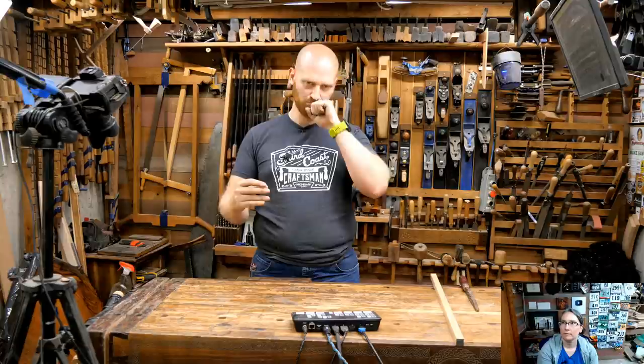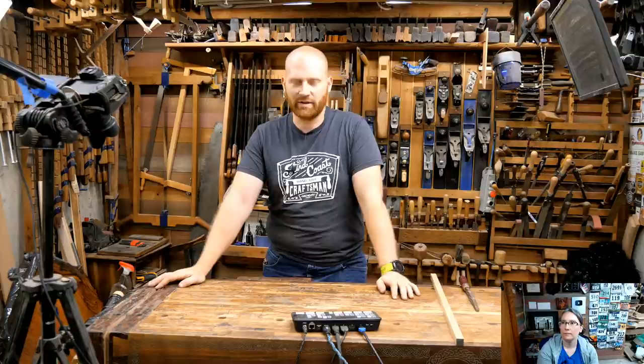That's generally considered the best way to do it because you're not heating it up too much and you're not creating too much tension inside of it. If you are really, really, really good with welding, you might be able to get away with welding. The farmer fix is to actually rivet on or bolt on a plate to the outside. But brazing is usually the best method. It's not easy, but it can be done. So, yeah, good luck.